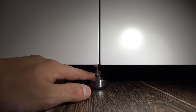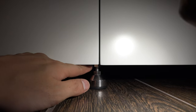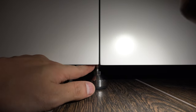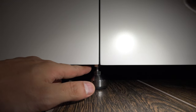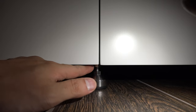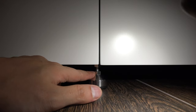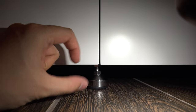The next issue was the leveling legs. The instructions just tell you to screw them in but don't tell you where the nuts are supposed to be. There are supposed to be two nuts - one down close to the actual leg and one at the very top. If you have both at the same location you're going to have a hard time locking the leg in place. The nuts are opposite: one tightens up top, the other tightens at the bottom.